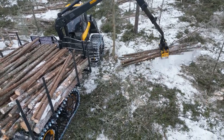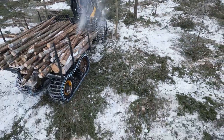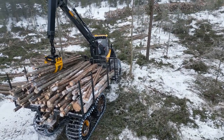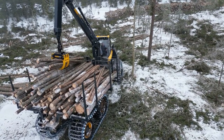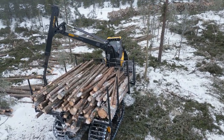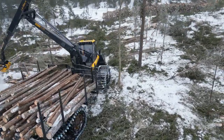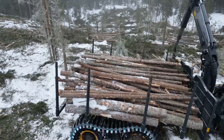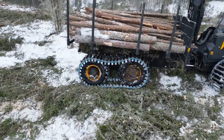in South America. The PONSSE Active Crane is a loader control system for forwarders, with which the operator controls grapple movements instead of individual functions, allowing the operator to concentrate effectively on working with the loader. Active Crane is easily controlled using two levers, one of which controls the grapple height from the ground, and the other the direction of movement.